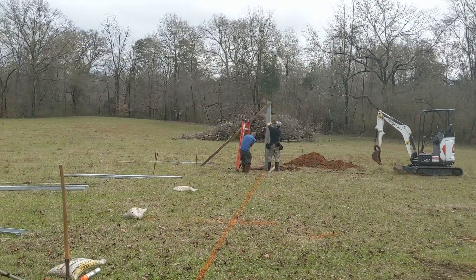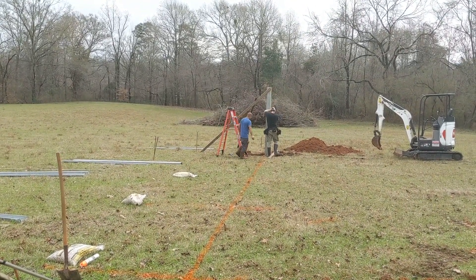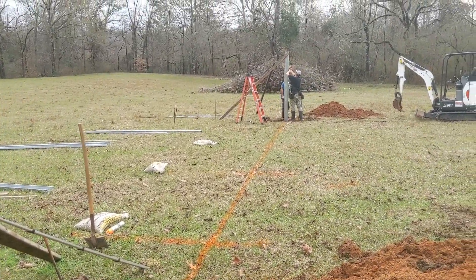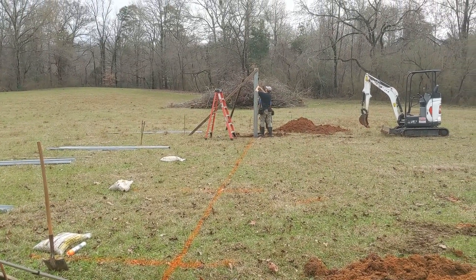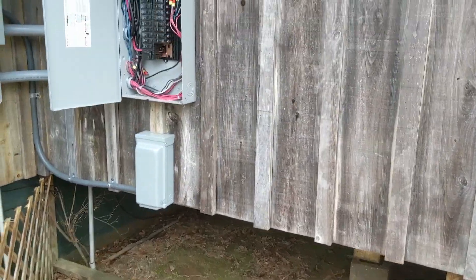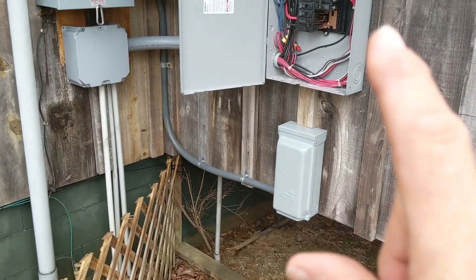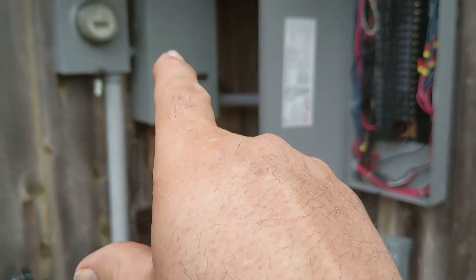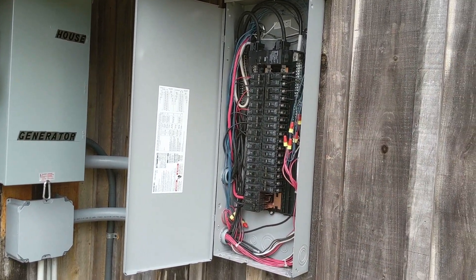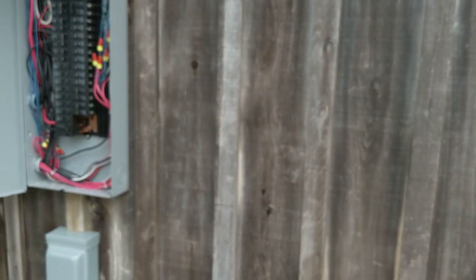These are too small to justify a pile driver at this point, so we just dig in concrete. This is the style for concrete, this C-channel too. You can drive them, but it might take us an extra day. Getting set up to build the electrical. We had them rebuild the service entrance to get prepared for us. We've got a generator inlet here, a manual transfer switch, their grid panel, and back-to-back with that is our critical loads panel. There'll be some gutters, wire troughs here, and a disconnect.